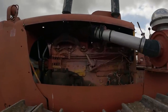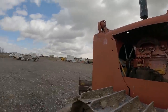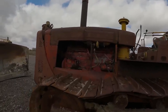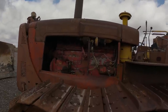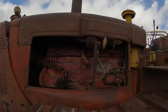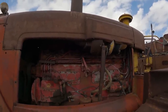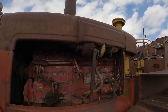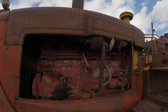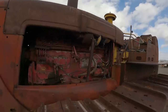Naturally aspirated, I think these are about 180 horsepower is what they're rated at, without a turbo. This one's like a 1949 TD24. The other one's called the 241 series. This is a straight 24. This got a turbo on it. Dad had a couple with turbo. Got another 241 down in the junk pile. It's got a turbocharger. With a turbo, I think you get as high as 205. Some of them in the book it said 240 if you wanted to open the fuel up to them.